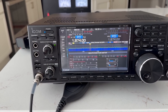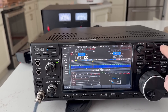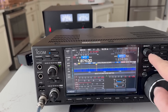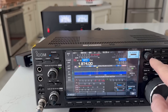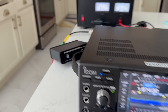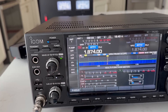So I'll show you what kind of performance I'm getting. The ICOM 7610 has band stacking, which means you can press the button multiple times and store multiple modes. What I do with each band is make one of the band stacks RTTY, so I always tune up on RTTY. I've experimentally found that at 1.8 megahertz you need about 10 watts, and on the rest 6 watts works well. You press the little controller button, the band drops momentarily, then I hit transmit and you can watch the SWR while it thinks about it.